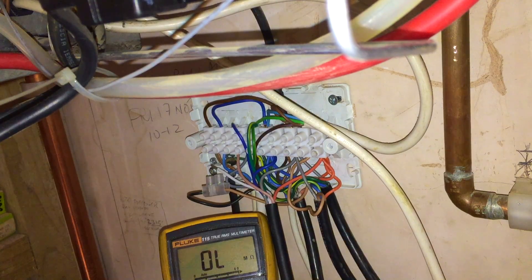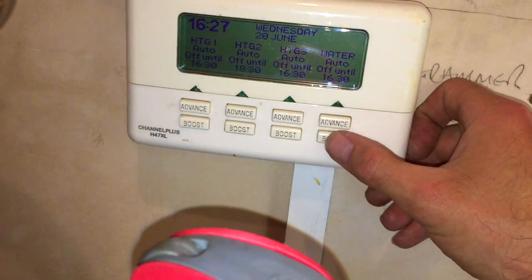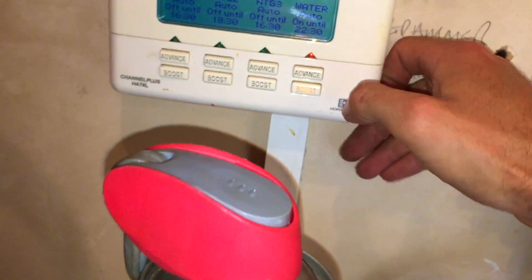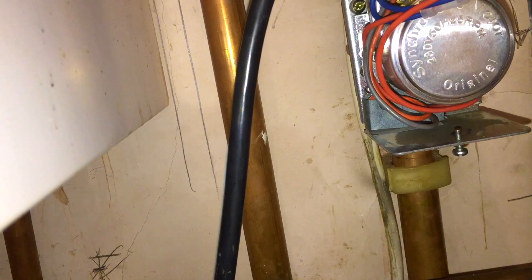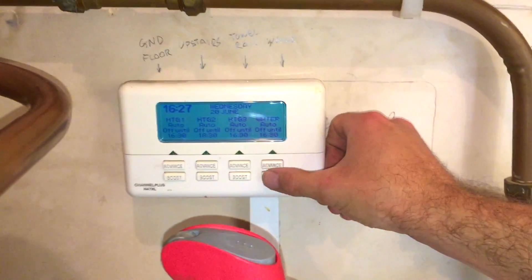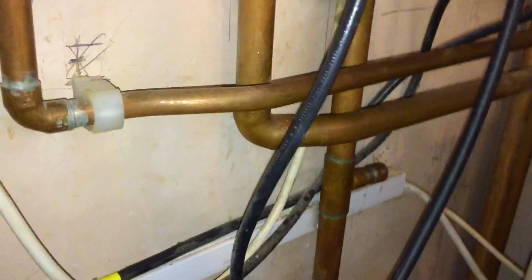Okay, so let's see what happens now — this is all back together. I'm going to turn the water on on the timer. Water's on on the timer, and it is motoring over. And it just clicked — and there you go, everything's working. Turn it off — you hear the valve motor back. Click that on. Around here is where I looked — you can see the arm moving, click the micro switch and hear everything click on. And there we go.